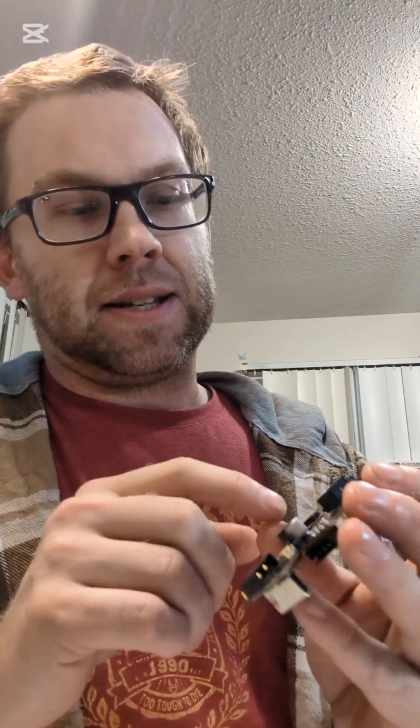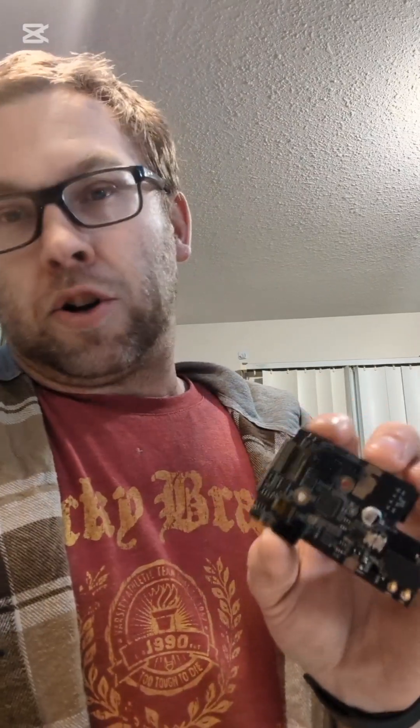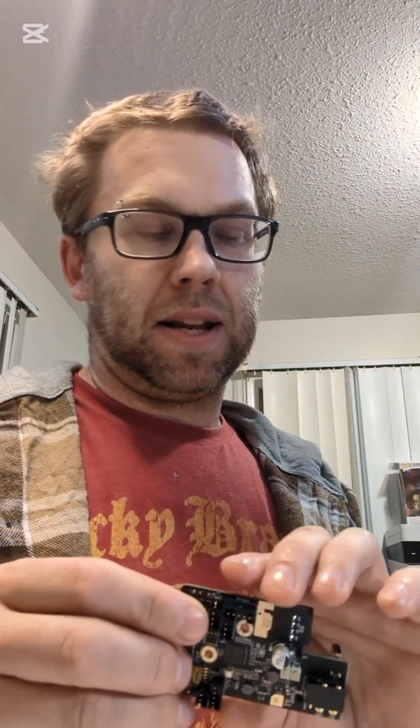The downside with the version 1 EBB is that fans have only one power option, so they must both be 24-volt. Don't mix 5V and 24V or you'll fry one or under-power the other, depending on how you have it pinned. That's the main drawback of these boards.